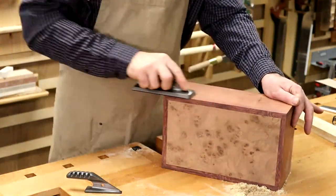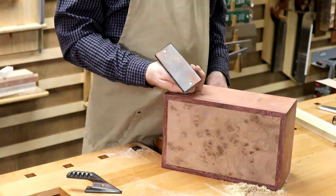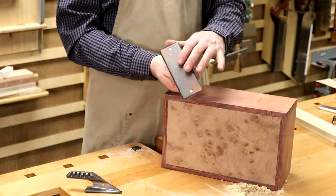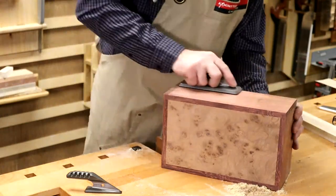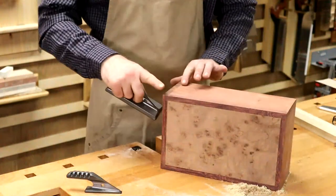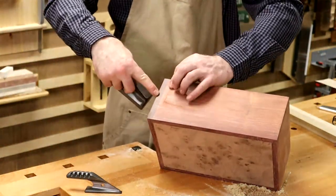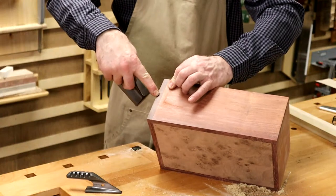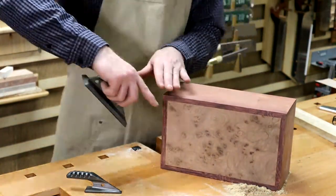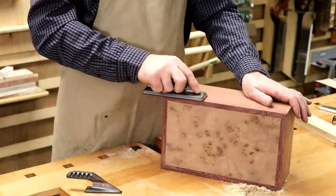Cuts effectively, little resistance, going to last longer than abrasive paper. That's a downside, we don't sell you as much, but okay. So you're not going to wear it out like you do abrasive paper, or you don't throw it away. Great for, and I found them fantastic for leveling this end in where I've got the end grain and the side grain, my halving joint. If I try and go in with a block plane, oh, I'm going to tear the corner, I've got to change direction. This, wow, right into there.